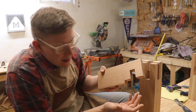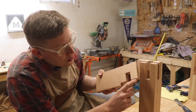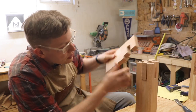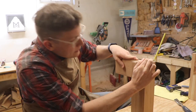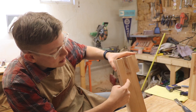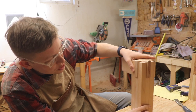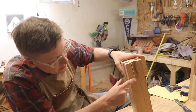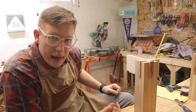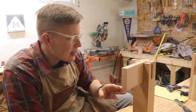As it stands, I don't think it's going to make any difference for the structural integrity. This is an easy notch to cut out, but I do want to have that little notch on the outer edge, because eventually, when I put this on here, the chamfer is going to start at 4 inches, or the taper, rather, and it's going to be tapered, you know, like this, just ever so slightly. And I want that to start at the 4-inch mark. And I think it's going to look strange if I have this cutting off at 3.5 inches, and then the chamfer starts at 4, or the taper starts at 4. I'm just rambling now. But anyways, it was pretty straightforward, and I liked it.